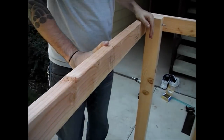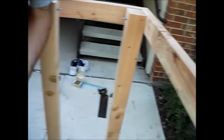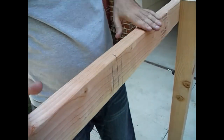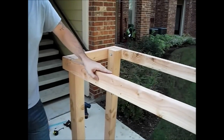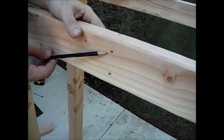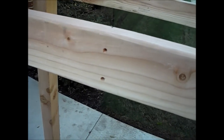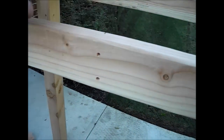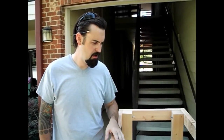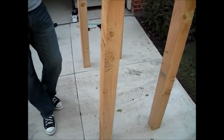The next step is setting a support piece in the center. I've marked two feet on both 2x4s and set a center line with outer edges so I can make sure the 2x4 is truly centered. Before setting the center brace, I drilled tap holes so the wood wouldn't split, and drilled offsets with the 1.25-inch wood boring bit so the screw head has room and doesn't cause splitting. Now that piece is in — it's flush to the tops and level. Moving on to securing the base and making sure the entire project is square before laying the plywood.